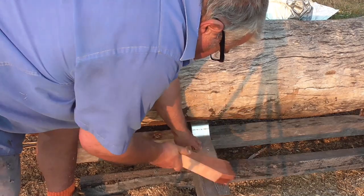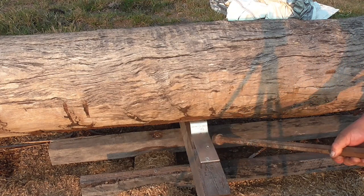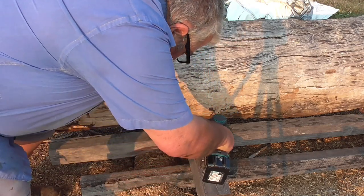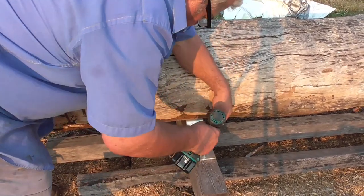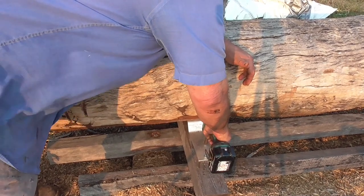What I'm doing here is cutting the slot for the log dog to go in. I'm only using self-drilling metal screws for metal roofing, not for going into timber. They don't grip as tightly, but they're adequate — and I find they don't bind in there so that I can't get them out, the way screws designed to hold in timber would.